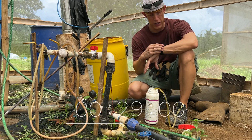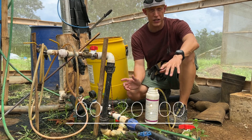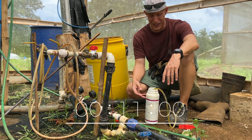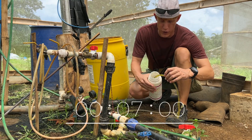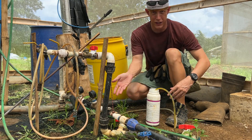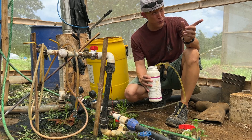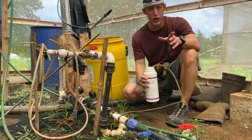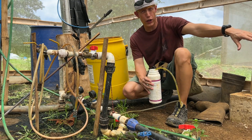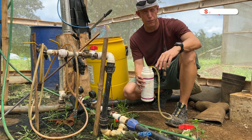It's one of the easiest, fastest, and most accurate ways to find out what your irrigation is running, so you can make adjustments to growth size and application — how much water to put in a tank and let everything play out from there. It uses products you already have. In this time frame — looks like there it goes — it took us 27 seconds, so we're a little bit faster than we need to be. But that's good because we've got 840 drip spikes out there. I know that when I mix my mixture, it'll apply over a specific timeline. The mainline pipe applies water mixing with this — one liter every 30 seconds — so I can fill this with 20 to 40 liters and deploy it across the whole greenhouse.